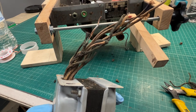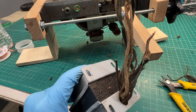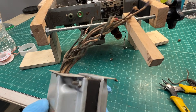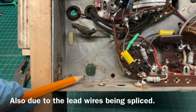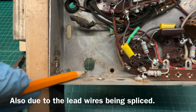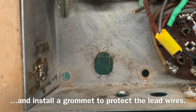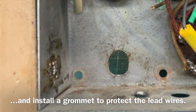Again, the conductors themselves — the protective coating is frayed in numerous locations. I'll probably break the housing down and see if I can better protect those. I'm just guessing the power transformer is not original. You can see how this is drilled out — usually from the factory it'd be a lot cleaner. I'll definitely need to expand the diameter of this hole on the chassis to get the leads back through from the power transformer after dressing those back up a bit.